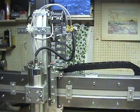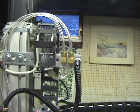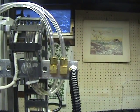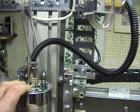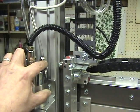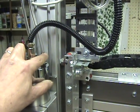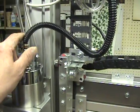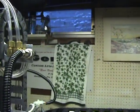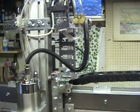I have my coolant lines coming in and they're hooked into the compression fittings. I just needed to heat the end of the tubes up a little bit — they slid right on. You do have to press down on the nut just a little bit to get the thread started, but it went through pretty good. I also have my separate wire attachment here for a quick disconnect for the spindle, with a little bit of conduit cover on it to dress it up.